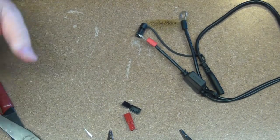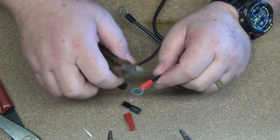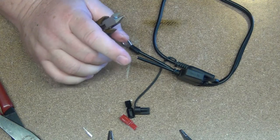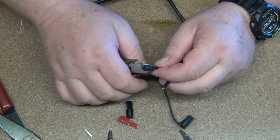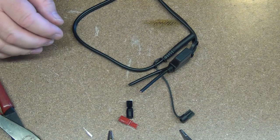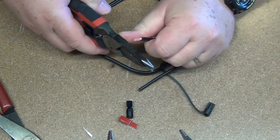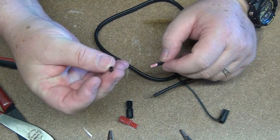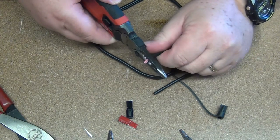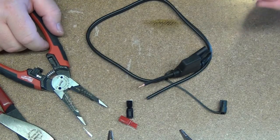Like I said, when I'm done crimping I'm going to go ahead and solder them. Let me get my flush cutters and chop this off here. This is a lot of what you see with Japanese wire — it looks like very heavy gauge wire but in reality is not. It actually has double insulation: there's an outside piece of insulation and an inside piece. That's still a fairly good chunk of wire — I'd think about number 14 gauge, maybe.